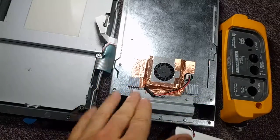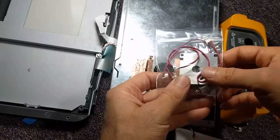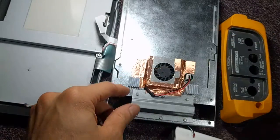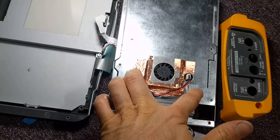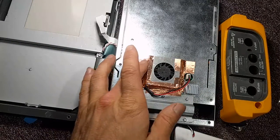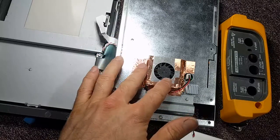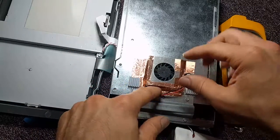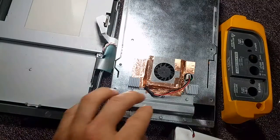I'm actually feeling pretty confident about this now. I found one that's low profile enough to replace this guy. He had a little extra aluminum on here for heat sinking possibly, so I went ahead and added some copper foil and then some extra little heat sinks I had laying around — plenty of room for it. The copper also doubles as air ventilation, to make sure the air is still pulled up from below and not from the sides, because there is a bit of a gap with this particular replacement fan from my parts bin.